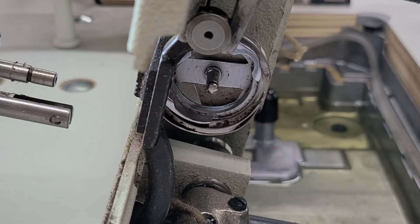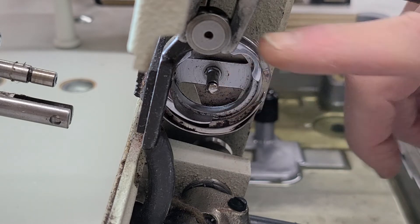Make sure you clean that off — you don't want any of that debris on there. Then I'll try the machine again and see if it's still doing that. Those are the few places where I would see damage that could catch your thread and shred it, and it would start creeping up. Usually it's going to creep up toward the top of the machine above the needle — you're never going to see it down here.